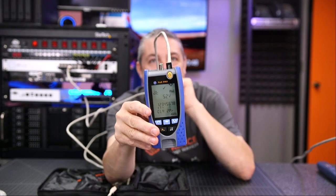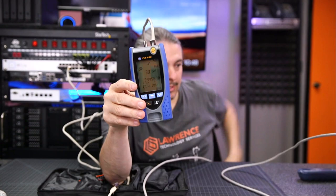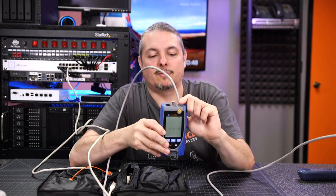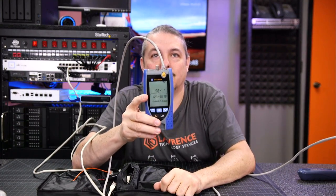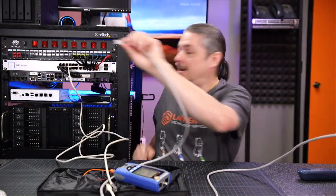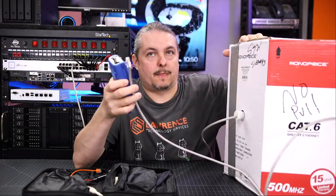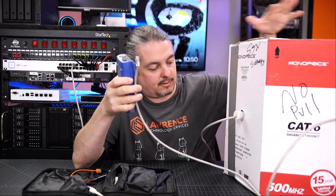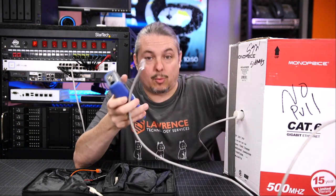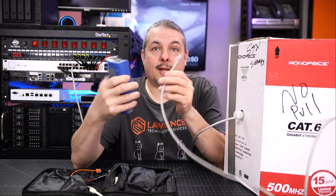Things can cause problems though. Let's go back to this really long cable — 500-something feet, which is further than you're supposed to run PoE. Let me measure it again. I think it was 580-something feet. So we'll plug this in: it reads 584 feet. We're going to plug this cable into the PoE port and grab the other end.